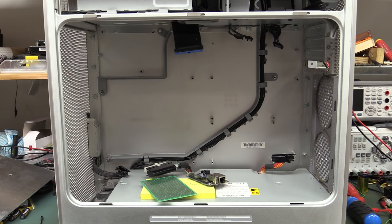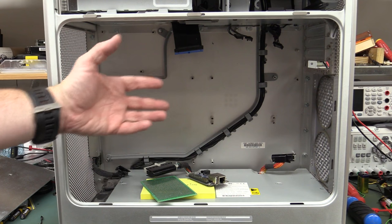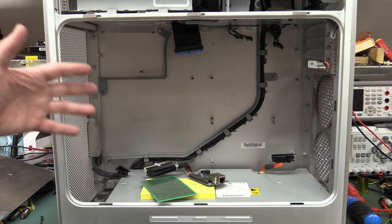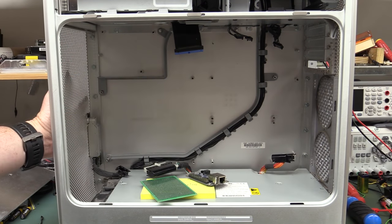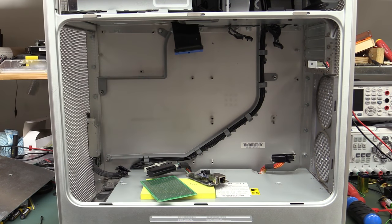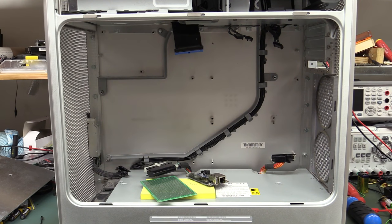Now, of course, one of the big things on a supercomputer, like a clustery thing, anything high-powered like this, just your regular PC, of course, the airflow and the thermals of this are a big deal. Got the fans at the back, they'd be blowing out, so it'd be sucking in through the nice front grille here. Oh, I can see my hand. Look at that. It's beautiful. Love this case. Oh, it's pornographic. Really is. So you want a nice airflow with as little resistance and as little turbulence as possible in there.